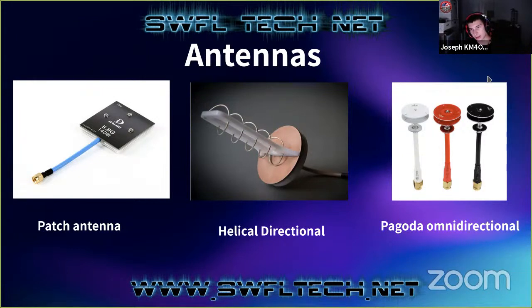And then there's a new kind of antenna that's come out recently. That's the pagoda antenna, and it's an interesting design. I haven't seen any ham antennas like this, any lower band antennas. It's like two discs stacked up with a third underneath, and it's another omnidirectional. I do believe it radiates up and down as well as it does on the sides. It's definitely going to be a lot more resilient to impacts because it's literally just two discs stacked up. So there's not really much to bend or break off tune there.